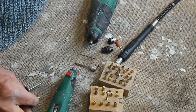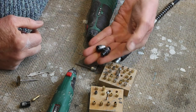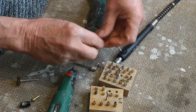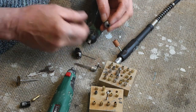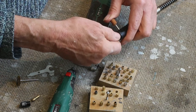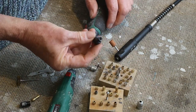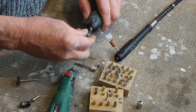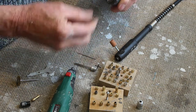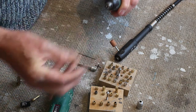But there is another way of doing it. What I've got here are universal collet chucks. I've got these in two different sizes — my Parkside tools take a 7mm and the Ferex tool takes an 8mm. The Ferex tool comes with exactly the same type of fitting as the Parkside tools but the collets are bigger. A universal chuck fits straight onto the end of the tool and will fit any size of tool you want to put in it — as you tighten it up it acts exactly like a drill chuck, the little teeth come up and grip the tool.